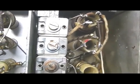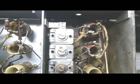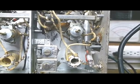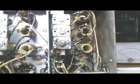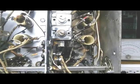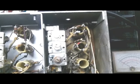So now I'm going to move on to band 2. I'll take this coil out right here and see what it's going to take to try to get that one repaired. It looks like all of 5 bands, the antenna coils, the primaries of them are burned out. I just can't imagine. As I said, I guess the only thing that would do that is if he had it in band 5 and all of those coils were in series. I'm just not sure how that could happen. But we're going to try to fix them.